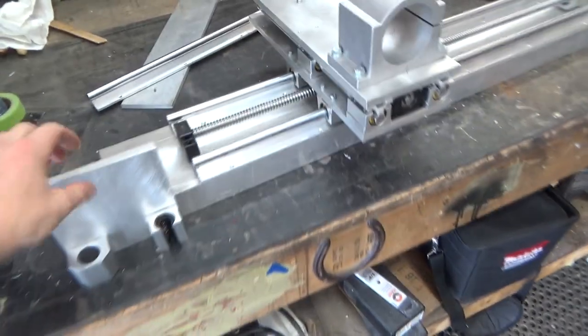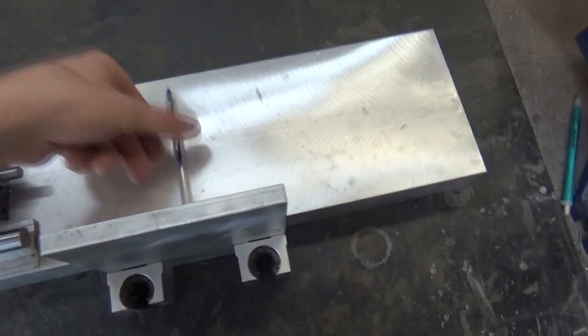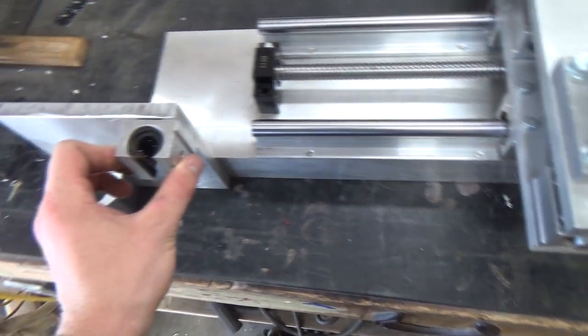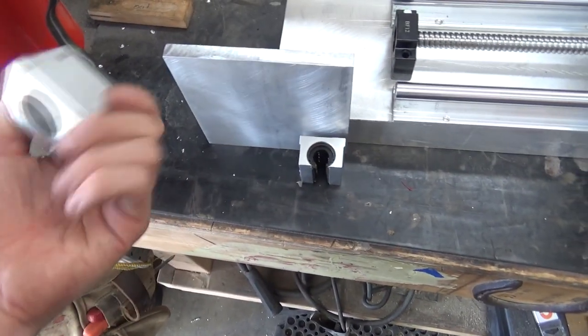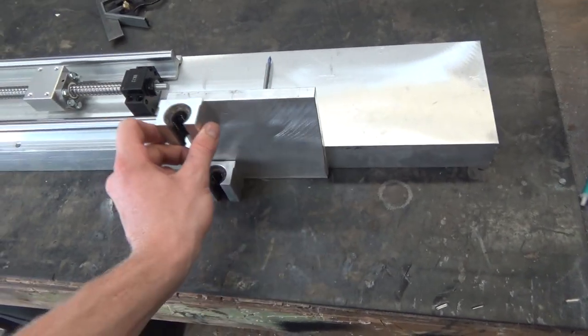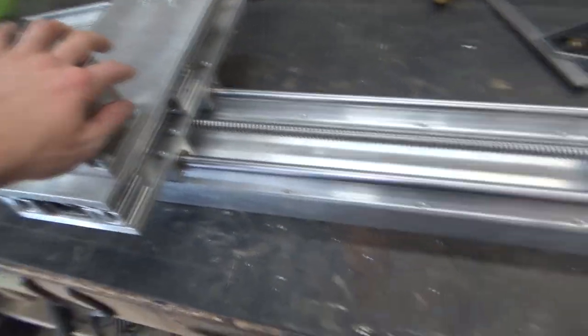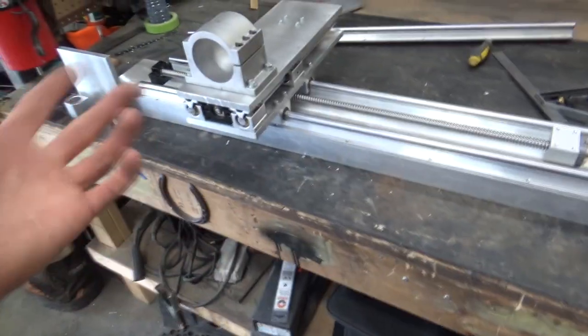This is what I'm thinking so far: these 6-inch by 6-inch plates will be welded halfway and halfway on the end of this, and same over here. This channel will be cut roughly in the middle, and there'll be two slides on either side. The house for the ball screws is going to be on the outside, with the slide glides here. There won't be enough room to take this axis off whole because of the way I built the axis.